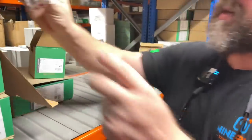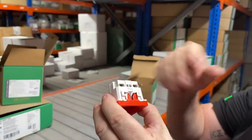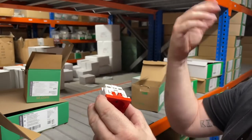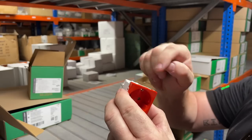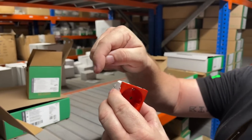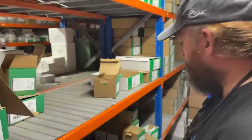So something like this here, as you can tell, there is in and out, but those connections are used for something else. Okay. If you've got a double pole switch or something like that. Or if you want to go in with the cables and out to a second socket or third socket or fourth socket. That's in the same box. That's within the same box, exactly, yes.